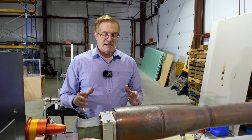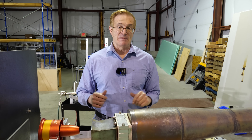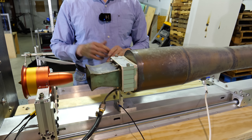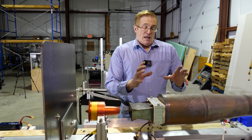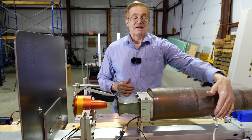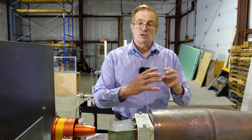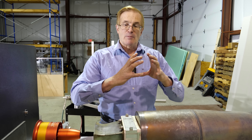The way these things operate is actually kind of fascinating. Before you start them up, the combustion chamber contains air. When you turn on the fuel pump and begin to pump fuel into the engine, you create a flammable mixture inside the combustion chamber. In this case today we're using gasoline, but you can use propane or diesel. Once you have established a combustible mixture, a spark can initiate a burn — a flame. When it does so, the flame begins to spread from that initiation point in an expanding spherical shell, like an expanding bubble, with the reaction zone of the gasoline and air representing the surface of that bubble.